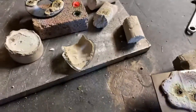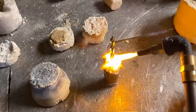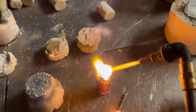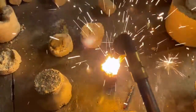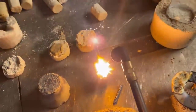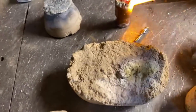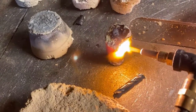We need to find a third ingredient to make this stuff stiffer. There's a drill bit that's encased in some of this material that's got a copper jacket, and I did this to exhibit the ability to create a high temperature dielectric separation between two conductors — which is something that comes up on occasion. You may find yourself wanting to pass electricity through a very hot wall. That's a copper protective jacket — and it's through the copper.